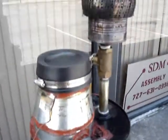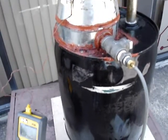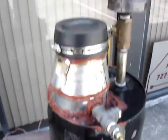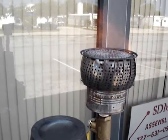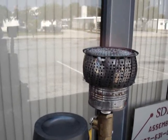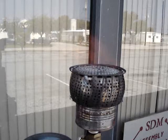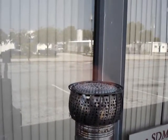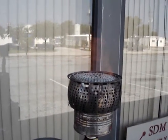This thing is just boiling hot right now. The outside of the tank is amazingly hotter than I've ever had it before. Something's gonna melt eventually, but it looks like high temperature is the key to reduce tar production. Before I turned it up, the flame was a lot brighter yellow and the temperature was down around 1,400. Now up around 2,000, there's a lot less tar apparently. So that's something to look into.